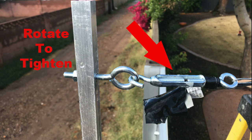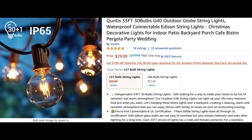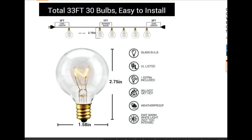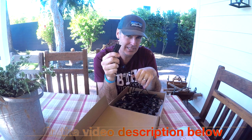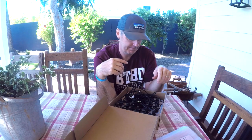Here's one setup — to the left as you're looking out — and again, the carabiner hooked into the fisheye. Now it's time for the lights. I've got about 33 feet from the house to the wall. These are 33-foot lights — not LED, though I would have preferred LED. More importantly, they're made in the USA. You've got to think about which side to run — keep the male end against the house where the electricity is. I'm going to run two separate lines, so I'll have two male ends against the house and connect them with an extension cord.